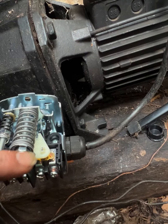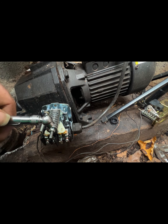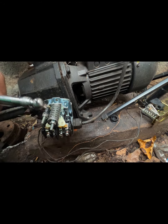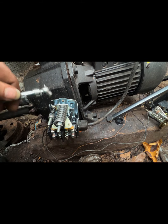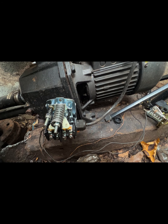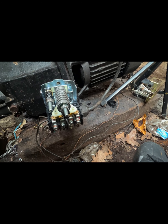If you have any issues with it turning off too soon or too late, this screw here — when you turn it clockwise — will raise your cut-on rate and your cutoff rate, controlling when the pump turns on and off. This other bolt, by turning it up, will raise the cutoff pressure — the point at which the well pump turns off. If you have any more questions, feel free to ask. Thanks for watching.